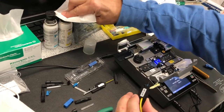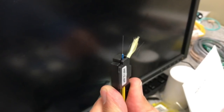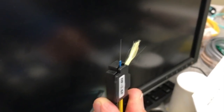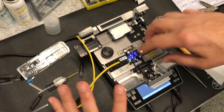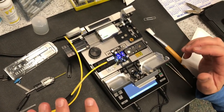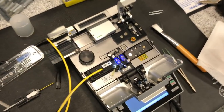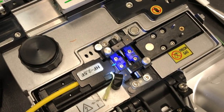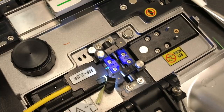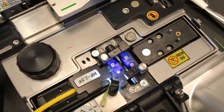The fiber itself looks like it's about less than the size of a needle — it's actually smaller than a human hair. Sometimes when you're doing splicing, a hair will fall into the splice area and the machine will think it's a fiber and say your fiber isn't clean. We're really dealing with microscopic-sized elements here — all of these fibers are measured in microns.